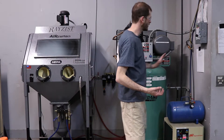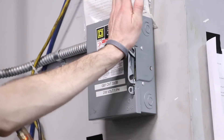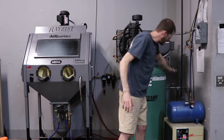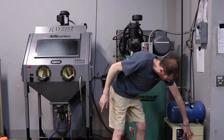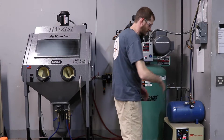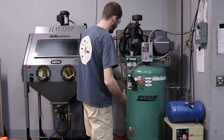We're going to make sure the air compressor is on and then make sure the main valve is open to the line. That will put air down into this air dryer, which you're going to make sure is on by holding down this red button here for about three seconds. This just dries the air a little extra so that we make sure we don't get any buildup in our system in the sand blaster.